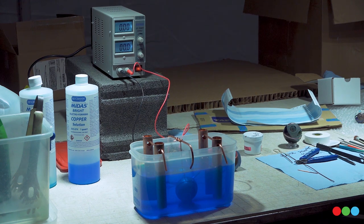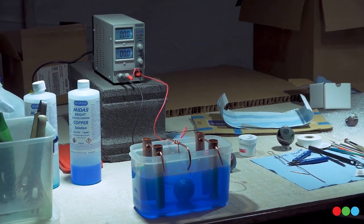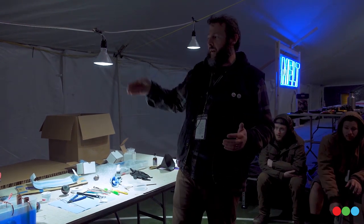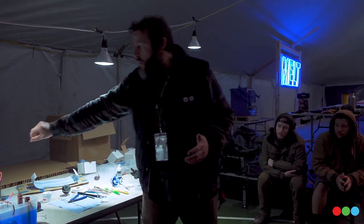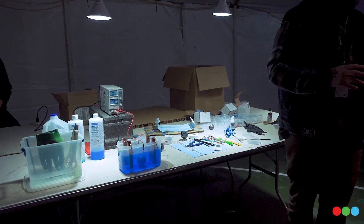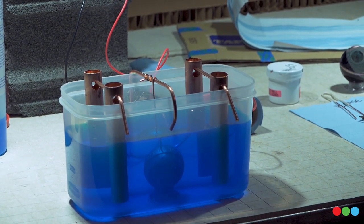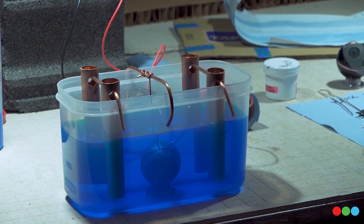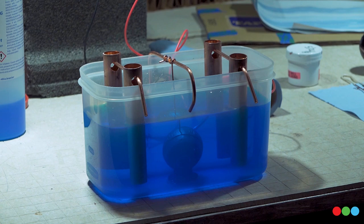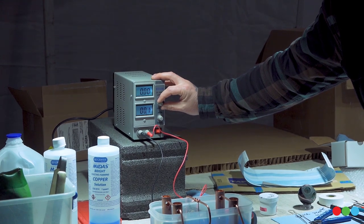and I don't completely understand this, but for these power supplies there's two different modes. One mode is a curvy wave, and the other mode is like a square wave, and I believe the difference is when you have the volts cranked all the way, like I do, it puts it into what I think they call a constant current mode. So it's more like how you set it, it's gonna be constant, versus if you were running a little motor, based on the load of the motor, is it gonna draw more energy? This just puts it in constant current mode, and that's what you wanna do with your power supply.